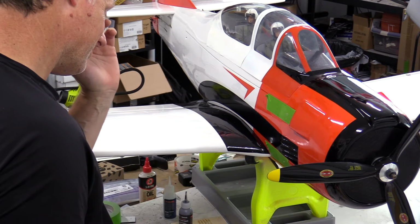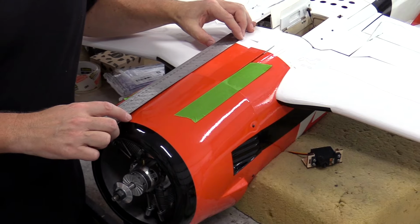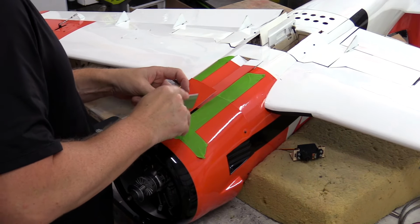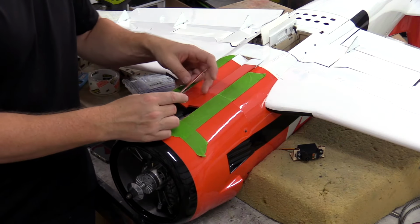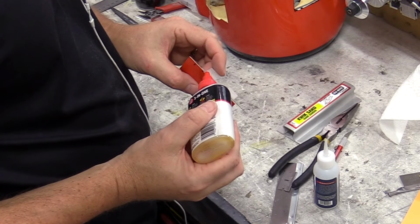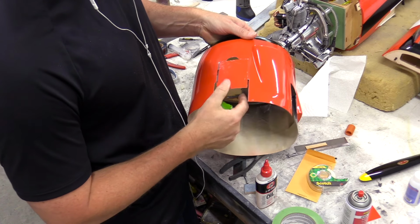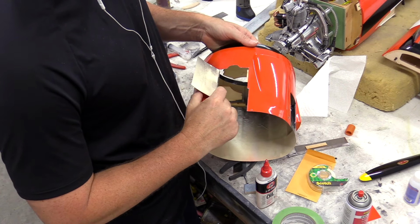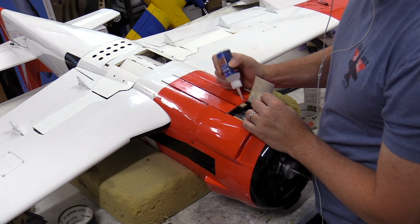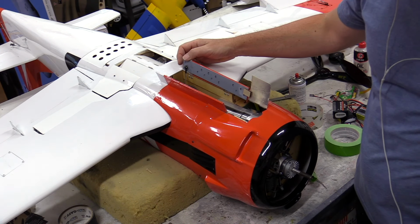But in the process, after I mounted the cowl, I plotted to make sure that you get this third gear door on the front. I cut that out and glued some hinges on there. Ultimately that door is glued to the main door on the fuselage, the twin doors. It's glued to the right one because it's a single door on the full scale front door. So when those doors close, with it being glued to the front door with the balsa wood tab, it pulls it closed at the same time. You do have to make sure that your hinges are all in alignment and all of that.